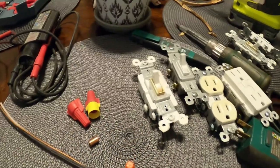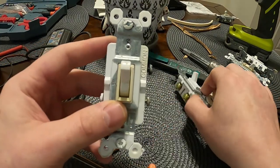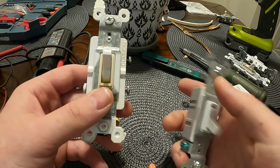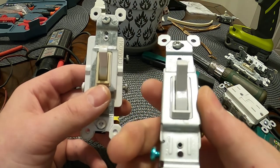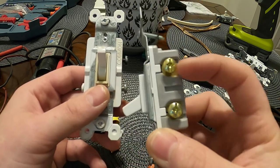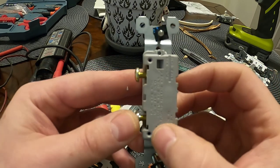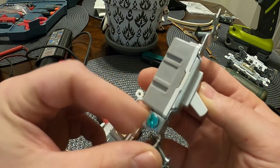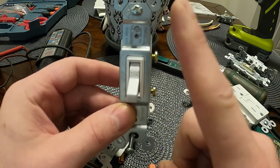My camera is falling — trying to do electrical work with a camera is a joke. So, typically you'll have two types of switches — well, three types of switches — but most commonly in a smaller house you'll have a single pole switch. That's like this one where you've got OFF and ON marked on it. When you take the switch out of the box, you'll have two points of contact on the front, two little holes on the back side, and then the ground screw on the side. That's a single pole — it will control a light from one location.